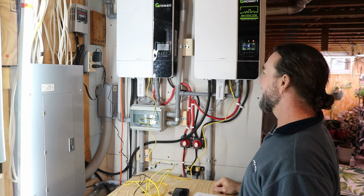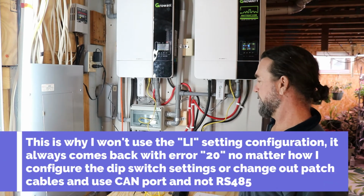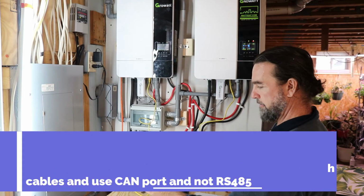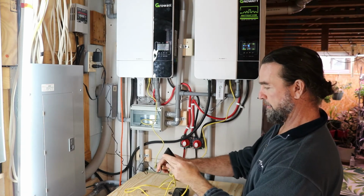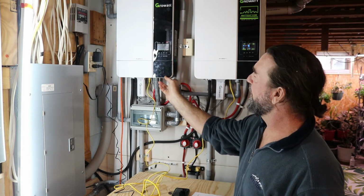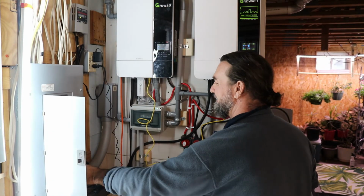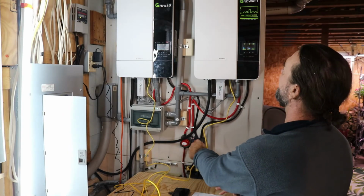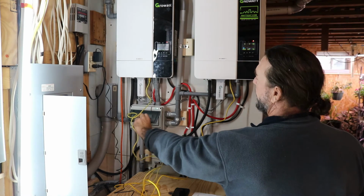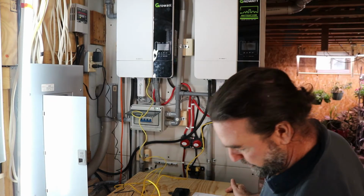Now, this is the conclusion that I came to originally. I've configured everything correctly. I'm going to go over everything twice, check it all out, make sure my little trusted hub is actually working, connected, has power. The little hub has power. I'm going to reset these one more time. Let's shut them off. Shut off the AC power. I shut off the quick disconnect on the batteries. And I am going to disconnect the PV. And I'm going to shut off the batteries.